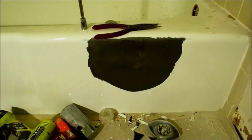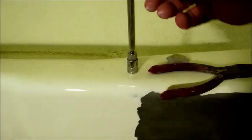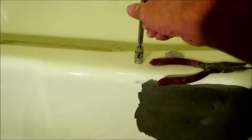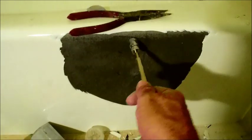If you had a thick metal tub built in from the turn of the century through about the 60s or 70s, you have to get that out — it's about 350 pounds to maneuver out the door. I've run into that a couple of times. When I see a magnet sticking I'm like, 'oh no.' If it's thinner metal built in the 90s or 2000s, you can just pop it out once the wall is down. In this case it's cast iron, so I'm not assuming anything.